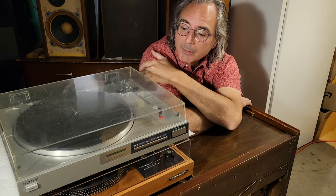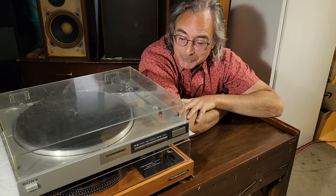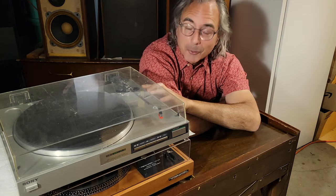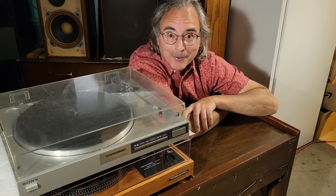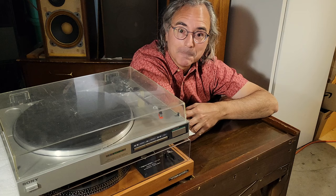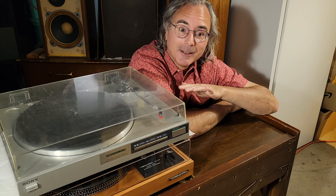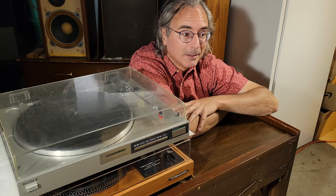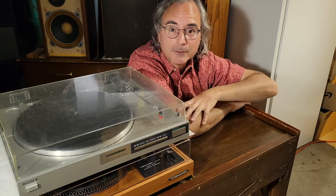I'm going to see what I can do. It may be something very simple. Generally these old turntables don't have a lot going on electronically in terms of the signal. They may have a lot going on electronically in terms of the controls, the automatic functions, etc. Like my Pioneer PL630 has a lot going on in it for controlling the speed, working the tone arm and all that stuff. But in terms of the signal, it's simply a straight wire from the cartridge to the back of the unit.